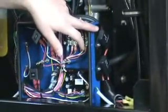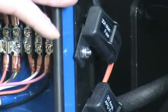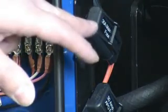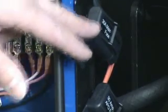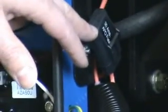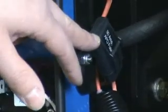On the right side, center and upper portion of the electrical control panel, on the outside of the panel, are located two fuse holders. These fuse holders both contain 30 amp automotive style two-blade fuses. The upper fuse holder is the main line fuse, which protects all of the electrical components in the entire system. The lower fuse is a 30 amp fuse for the APO system, which your machine may or may not have been supplied with from the factory.